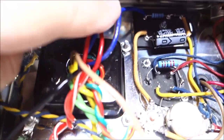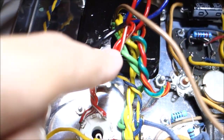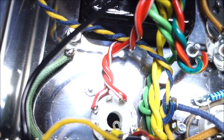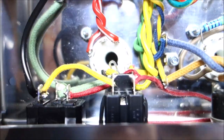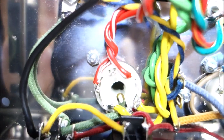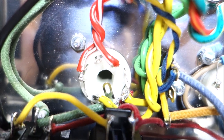the power transformer's in. These three leads are not connected, so they're shrink-wrapped and tucked away. Blue-red stripe is the bias. Brown is the 120 volt to the switch. Black is the one to the common. Red, red, white go down to pins 6 and 4 on the rectifier tube. And it gets tight because of this inlet here, or outlet, whatever you want to call it. And then the yellow leads for the filament of your rectifier tube go to 8 and 2,